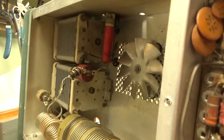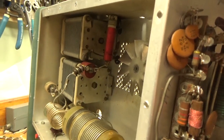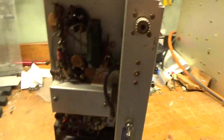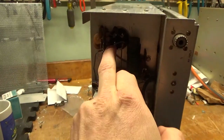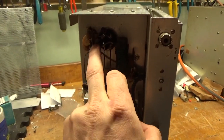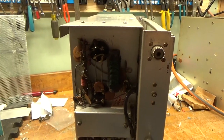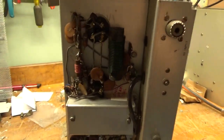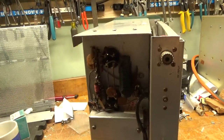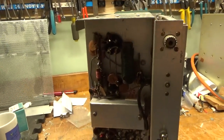I will oil the fan, check that out for proper operation. I looked at the air variables — the plates look clean. The rotary switch contacts look clean — that's the first thing I always do. I will change the 33 ohm carbon comp resistors; these values shift over time. I'll put in new 33 ohm 2 watt carbon comps — I have like hundreds of them. I'll pick a couple that are pretty dead nuts on to each other, within tolerance.